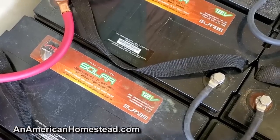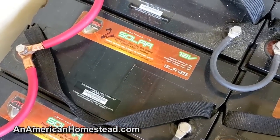And then when I moved into the fifth wheel, the trailer I'm in right now, I put 16 lead batteries in that thing. 1,200 pounds of batteries. Basically what we put in Tim's system. And it still never really worked like the math said it should. When I first switched over to lithium, I switched to lithium ion. You can get lithium ion to mimic 24 volt systems and 48 volt systems, kind of. Not quite a perfect match. But when I switched over, it was like, I now have batteries. Before, it was like not having batteries and only having power during the day when the sun was out, and then having batteries. It was radically different.